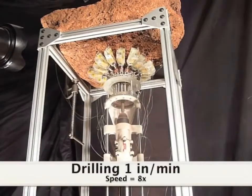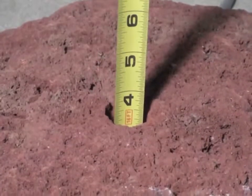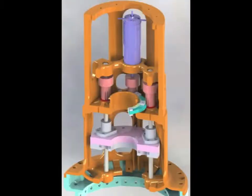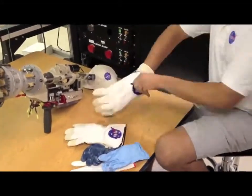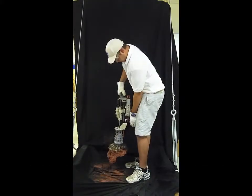Previously, we showed a rotary percussive drill that used off-board power and control with a hand-actuated gripper. We have upgraded this system into a self-contained power tool for astronauts. The gripper now uses a robotically driven triple lead screw to engage the rock, while keeping the center of the gripper clear for the drill bit to pass. Rock cores can be acquired in zero-G by a heavily-gloved hand.